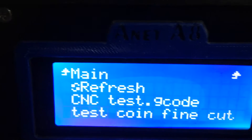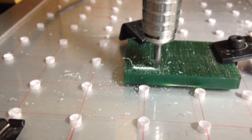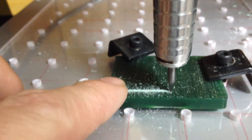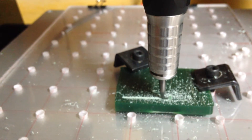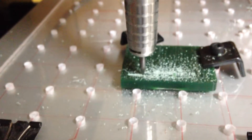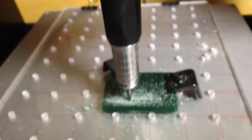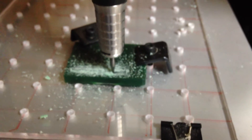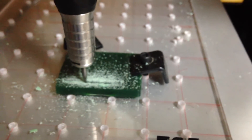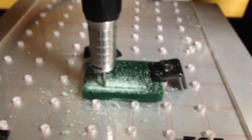Now I'm going to load the G-code. There's a lot of vibration because I didn't hold this side down. Also, don't use a fast plunge rate — use something maybe nothing above 80, or even less depending on what you're cutting. I have a feed rate on this one set to 250 for the plunge. That's how you load it up. And don't home, because you could damage your bed really badly.